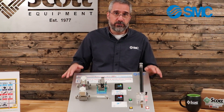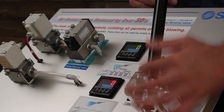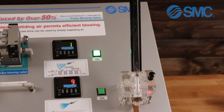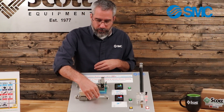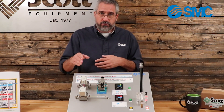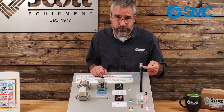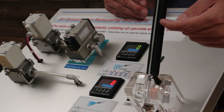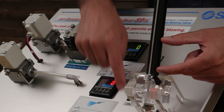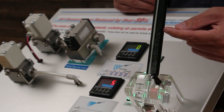The demo I brought with me today is very simple. I have an air nozzle in the bottom of this tube with some BBs, and we're going to watch the BBs go up and down in this tube to simulate the agitation you're going to get on the machine with whatever you're trying to blow off. I have two different circuits — a standard circuit without the pulse valve and a circuit with the pulse valve. When I run the standard one, you're going to see an initial high spike in these BBs — it's going to come all the way to the top of the tube, and then drop down to the middle. That middle level is what your machine is going to see on a day-to-day basis. It spikes, and now you're only getting about half of the movement in these BBs.